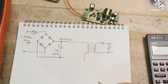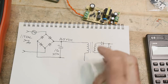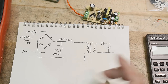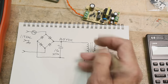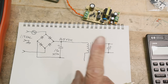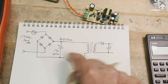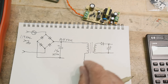Well, we're going to use a fancy chip, okay? I won't draw it in yet. One of the things, though, that the circuit has that we have to explain is whenever you have a coil and you let it go, it's going to generate what's called back EMF. It's going to generate a negative pulse. Remember when I did the tap, tap, tap, it created that big spike? We're going to get good current flow, but then when we release it, we're going to get a big spike.